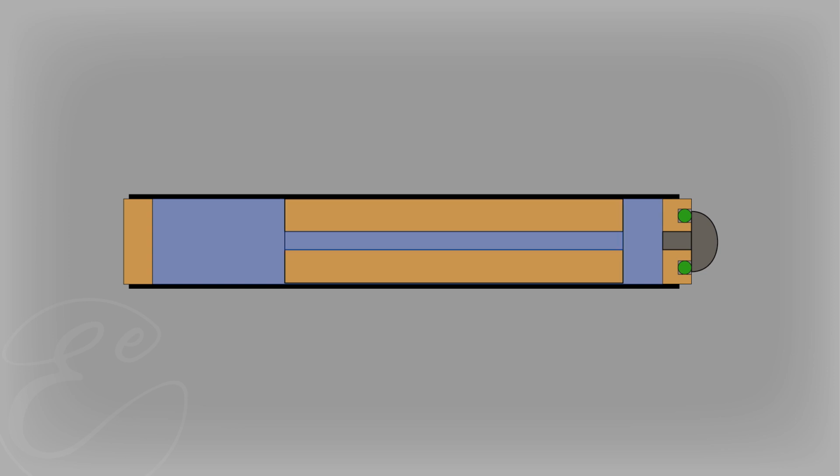This weight offers a method to transfer the energy from a change of momentum to the fluid. Essentially, you have to view the weight as not moving inside the hammer, but as the hammer moving around the weight. The mass is then going to have a hole through it. The relationship between how viscous the fluid is and the size of the hole within the mass is going to dictate the resistance and movement between the hammer and the mass.